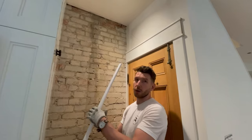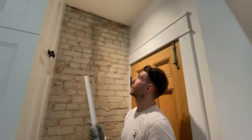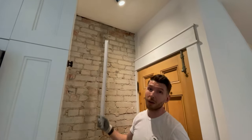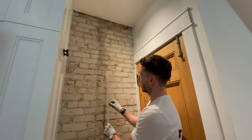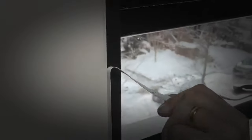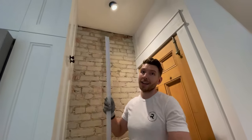You're thinking, okay drywall corner, that's easy — I just tape in a bead and it's now 90 degrees. But when you've got an irregular surface beading drywall, what do you do? Well fortunately Trimtex makes a bead that's designed for that. It's called a tearaway bead and it's designed to butt up against a surface that isn't drywall, and it's got a flap that peels off. The only problem is we don't have any of that here and we need this done stacked.